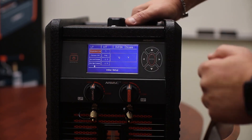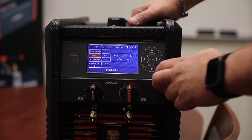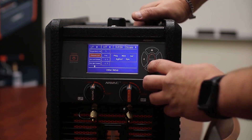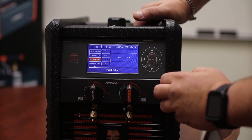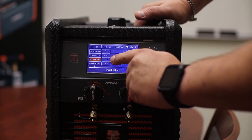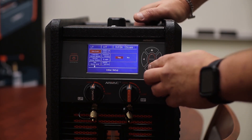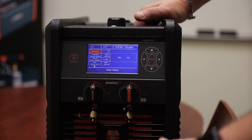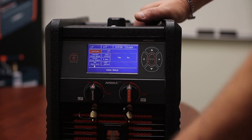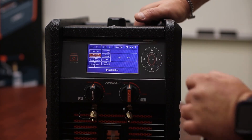Temperature units — we're doing Fahrenheit, already set up. PSIG versus bar and some of these other things. Zero the low pressure: if we had some residual pressure in here, just like you would zero your gauges, you've got that option for the low side and the high side. For the scale, if we've got some residual left there for whatever reason, we can zero our scale.